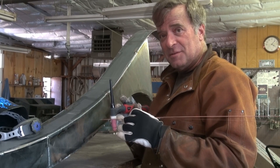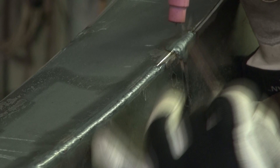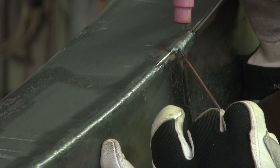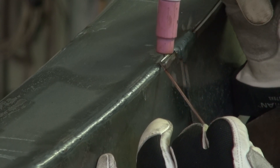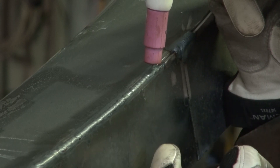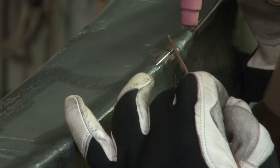Are you going to show us? Yes, I will show you. Remember: I'm going to start on top of the old weld, back up just a little bit, work my way down, start adding my filler, pull the filler out when I get to the next weld, work up into the next weld a little, back up a little, and stop. Okay, let's give it a shot.